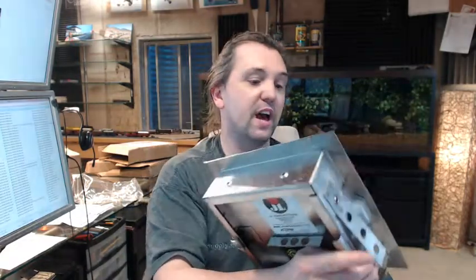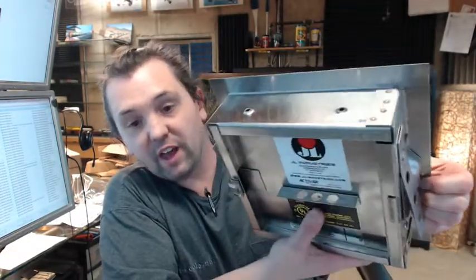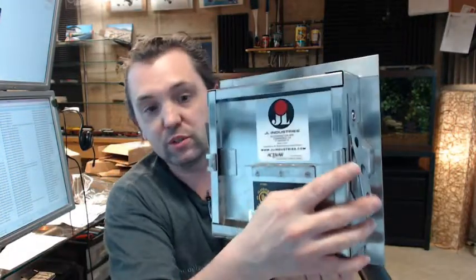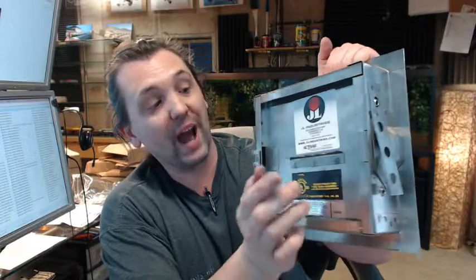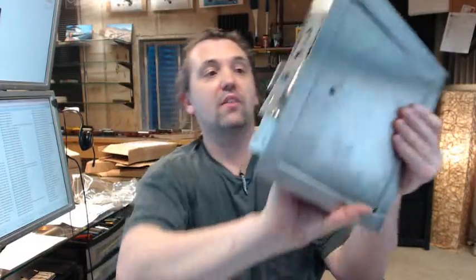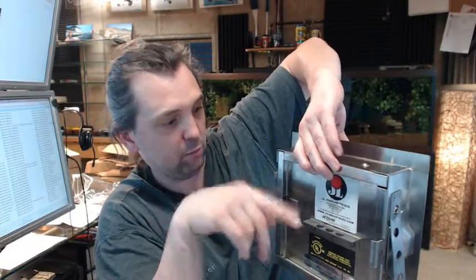You have an emergency latch release here. When you push it in — you have to push it fairly hard — if you were on the inside you would be able to get out that way. The door is locked from the outside, so this is your emergency release. What I have found is that getting it to work correctly depends on the door being tight against the inside of the frame; otherwise you get friction on the latch bolt. If needed, pull the door towards you and then push the emergency release.